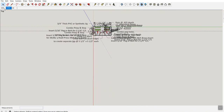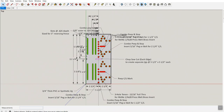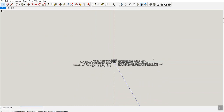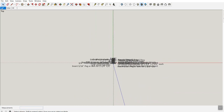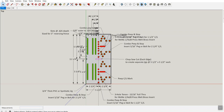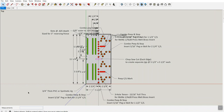Here's some other stuff on the drawing itself. But when I go to CNC, I make sure that number one, it's facing the same way it's going to be going onto the machine itself. And then I also zoom out to make sure there's nothing else out there that is going to carry over. So I go back to my tab, it's automatically going to where I want it to go. I'm going to do File, Save As, give it a name, and save it.